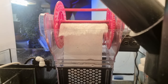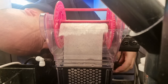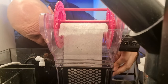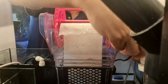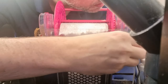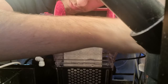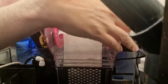You do have to turn that a little bit, but before I come on to that I'm going to install the water sensor. This is a conductivity sensor — it's really important that you get it the right way around. You can see I'm putting it at the back and you have to push it down. It's a little bit of a tight fit, but you push it down and click it into place. The connection for the conductivity sensor then needs to go into the back of the drive unit. Doing this blind is a little bit fiddly, but there is a notch at the top so you can just about see which way up it goes, and once you know that it should click into place nice and easily. There's a screw thread on it with a bit of a rubber gasket, so that should keep it watertight and stop any humidity or salt getting into the connectors.